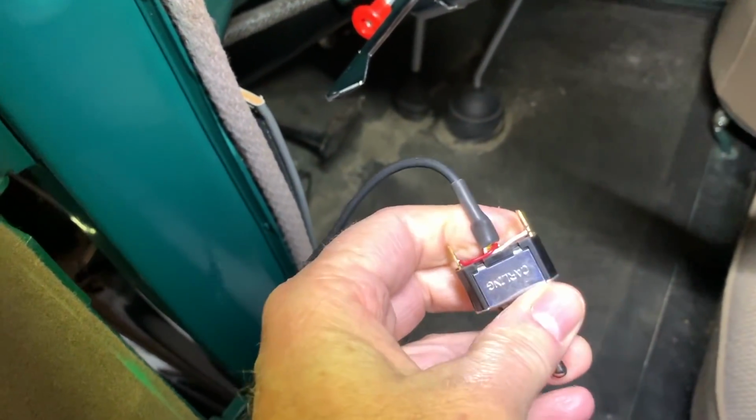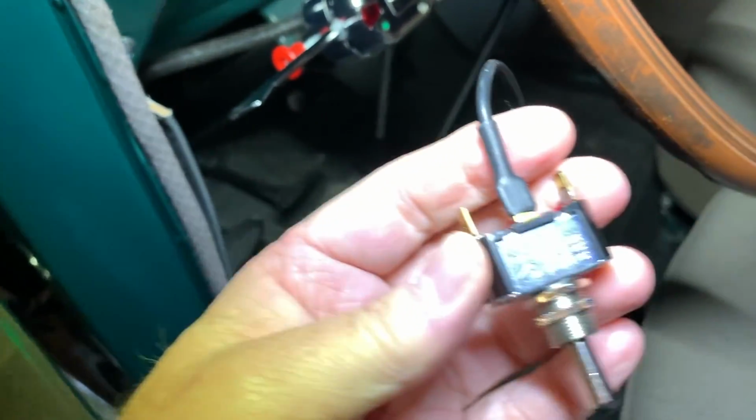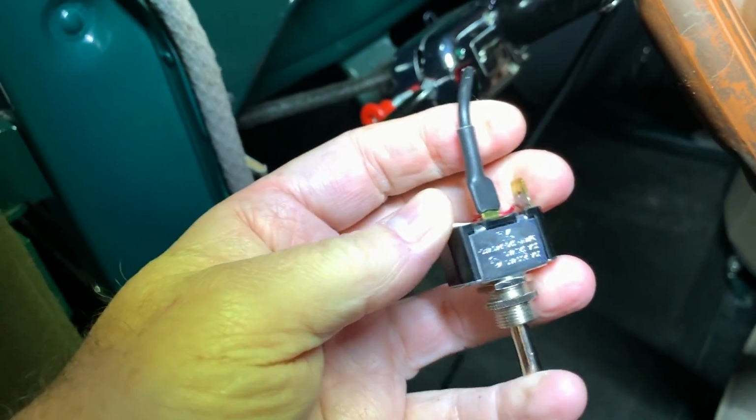Since this switch is pretty hard to press, I can't just have one L bracket. That would swing the whole switch when I tried to press it. So instead I need to make a bracket with 2 attachment points that will not move.